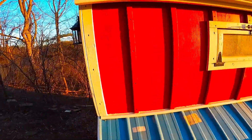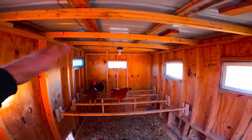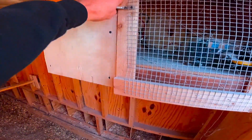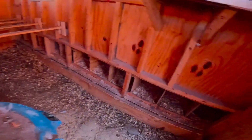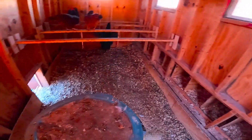This thing is built out of solid wood. I went with two-by-threes instead of two-by-fours because lumber prices are outrageous. Basically just built stud walls and then did a little lean-to roof — I think it's about three inches of pitch — enough that water runs down into the gutter. I haven't had any issues with snow. The walls are all two-by-threes, with plywood for separations for the nest boxes. I think it's 12 nest boxes total.